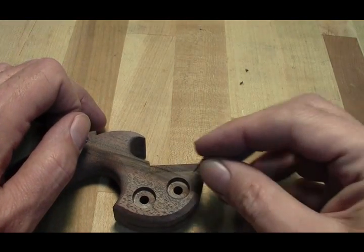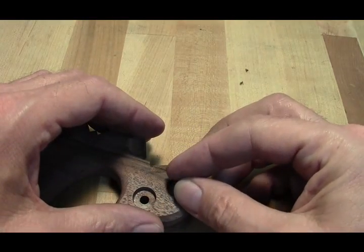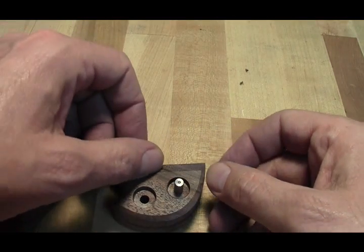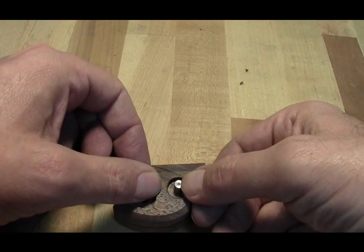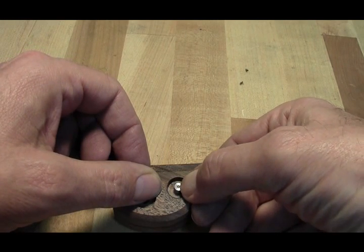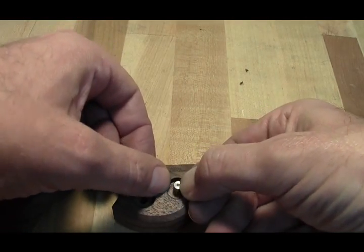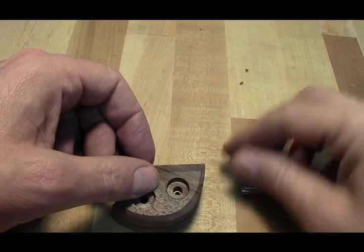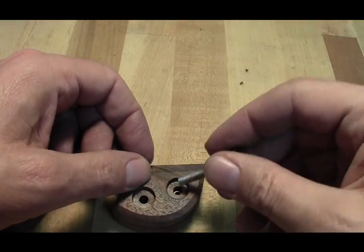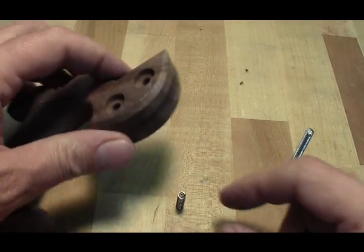So what I did instead was I dropped a spring in underneath it. I had a big bag of springs I'd bought with no general purpose in mind, which gave it plenty of tension against the bit. When the spring got bound up, it would stop it, but it got me far enough that I got my outside hole, got the hole here, and then I could center my bit on that to go without the centering device.